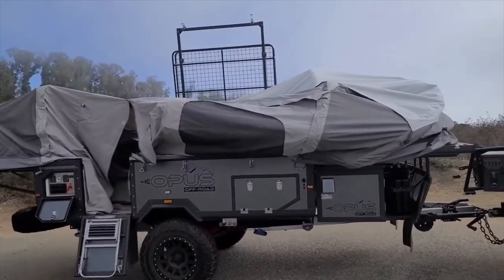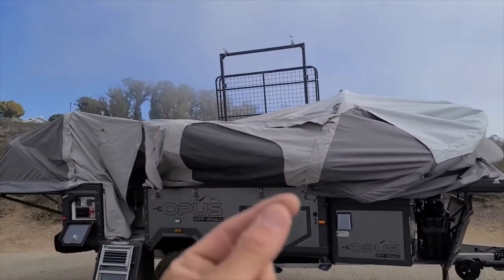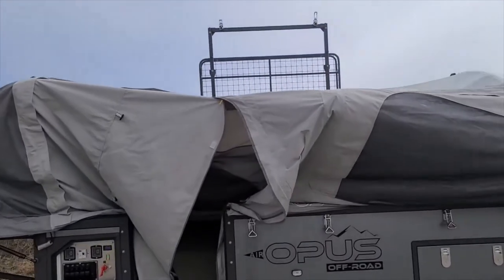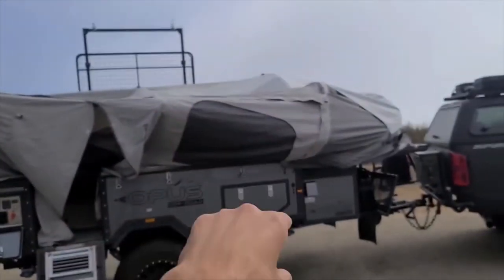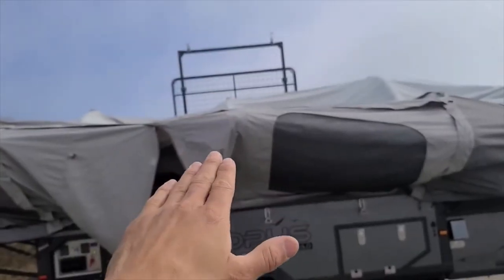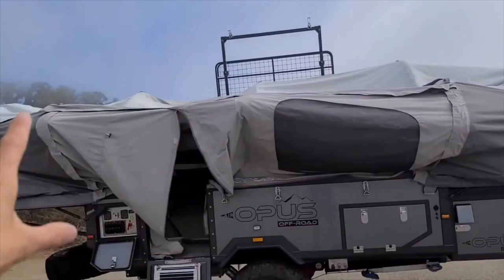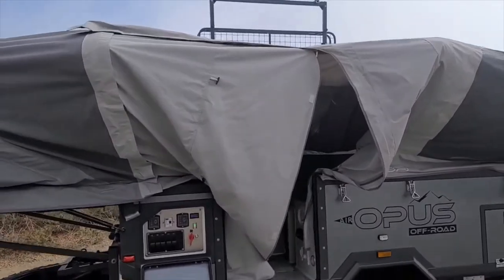It's amazing how they thought of this design. There are those tube frames going across and basically double protection of canvas around it. You can unzip and get to the tube if you want, but there's double canvas protecting it in case you actually pop one. There are more valves at each structural frame that you can cut off — so you can isolate the valve at each frame just in case you pop one. The other frames will stay up. Right now all of them are open, so all frames are connected through one air tube, but you can shut each one off individually, which is super innovative.